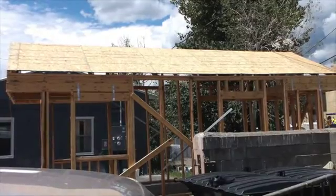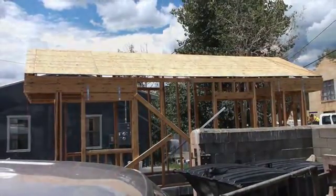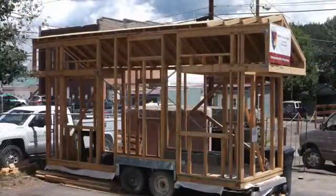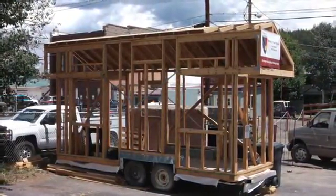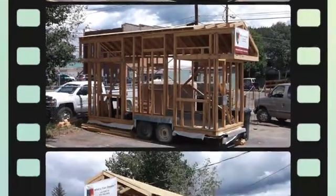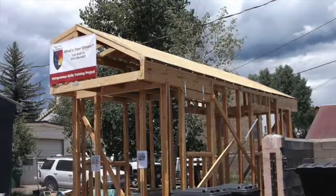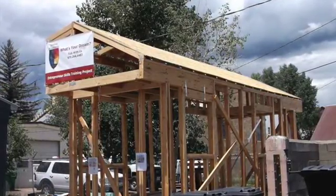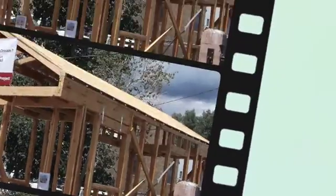The roof line was designed so that one wall would be normal size and then the other wall would be really tall, and we could put more windows on it, provide for a lot more solar gain, and also give a lot more headroom in the loft when somebody sits up. A peak in the middle of the loft doesn't allow a person to sit up normally and naturally.